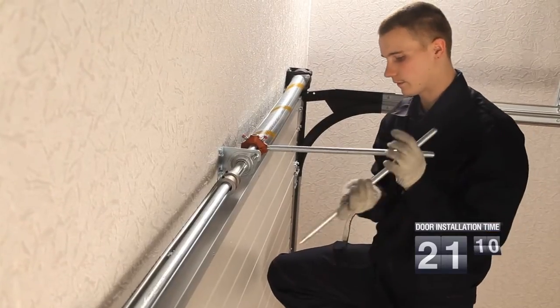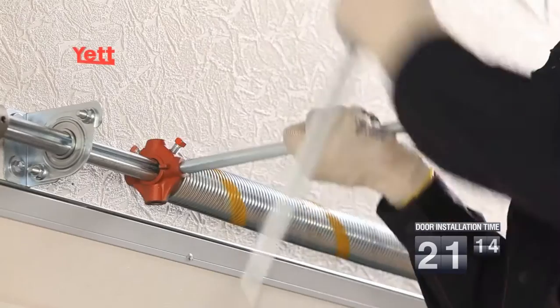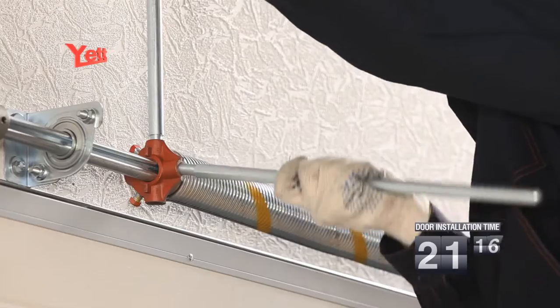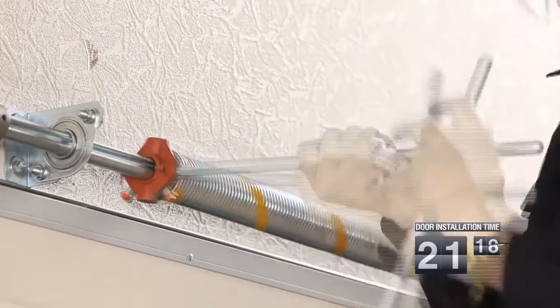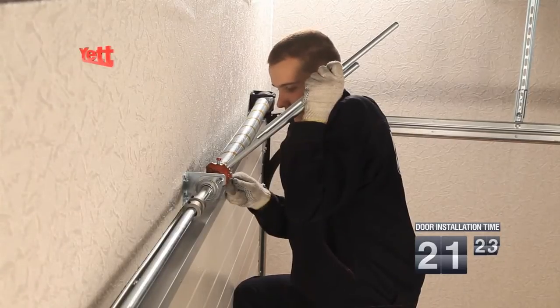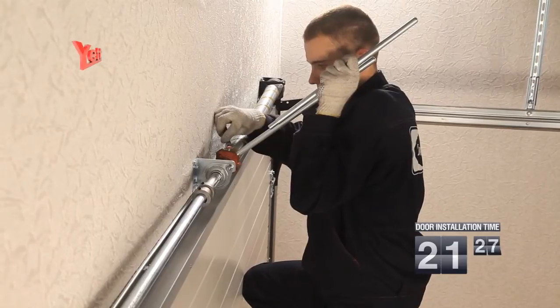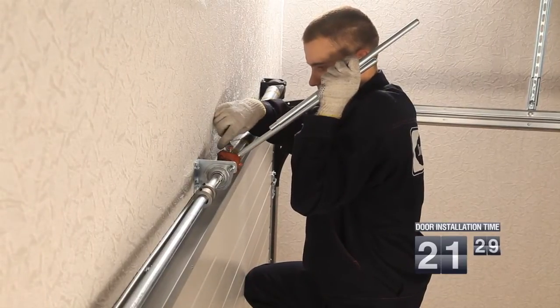After the installation of the torsion mechanism and the pull rope, it is necessary to cock it. The number of turns to cock the torsion mechanism is specified in an assembly card, and by means of a special bolt the spring is fixed on a shaft. The bolt should get into a groove of the shaft for strong fixing of the spring on the shaft.